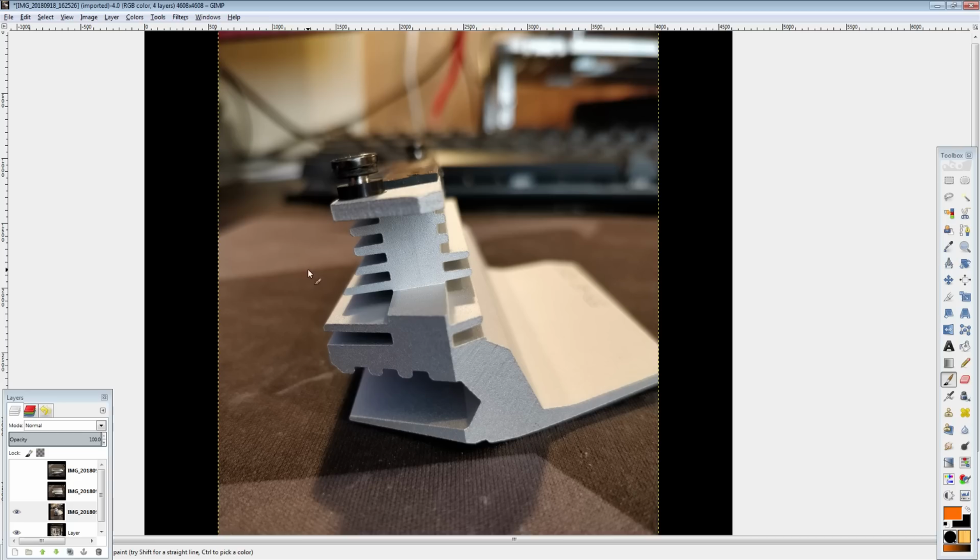Honestly, out of all the boards I've looked at, except for maybe the MSI X470 Gaming Pro Carbon board, the heatsink on the Carbon might be similar in terms of surface area to this one here. It's definitely heavier though, but in terms of actual heat dissipation capabilities, I think they might be about evenly matched. So this is one of the best heatsinks I've seen on any X470 or B450 board, except obviously up at the very top we have Gigabyte with the Gaming 7 board, and that has the proper fin stacks and the heat pipes.